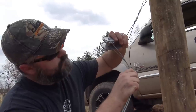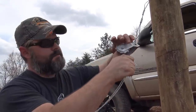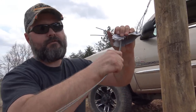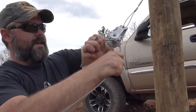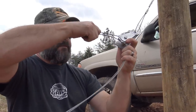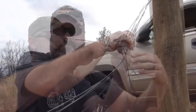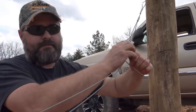There's an online resource Brian used a lot to build this fence. He used Stay-Tough woven wire — it's a high-tensile fix-knot wire. The manufacturer actually has an online guide that tells you about anything you need to know about building a fence: from setting posts, pulling wire, and building braces. Everything you'd want to know — it's a good fencing bible.